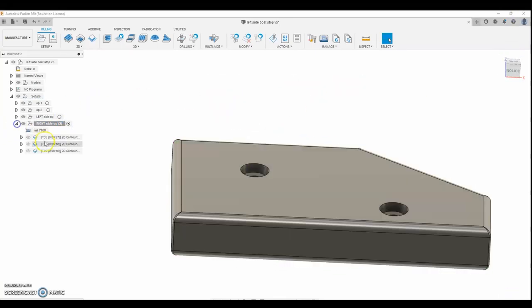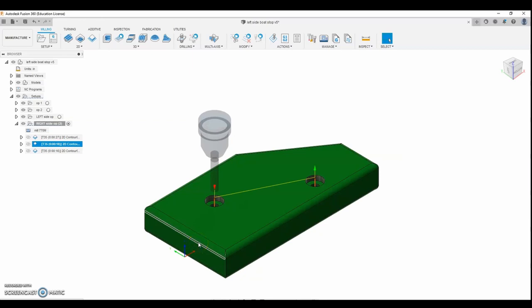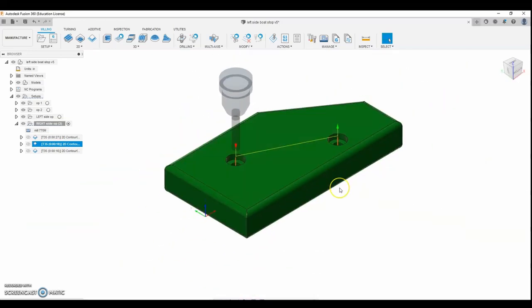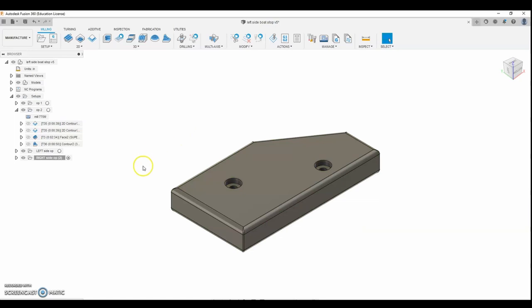The right side is identical to the left — same ramp, same everything. The big thing with plastic is making sure you're going fast enough that you're not melting or tearing the material — you want to be in the sweet spot where you're actually cutting, not ripping it apart. Keep as much heat out as possible. If you're having tolerance or hole size problems, it probably means heat is building up in the hole. I hope you guys learned something — if you like this format I'll do more in-depth videos. Hit that subscribe button and go watch the original plastic job video!